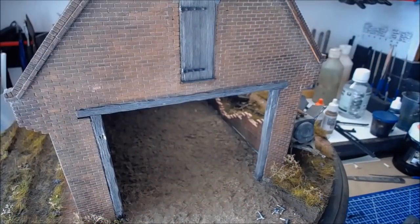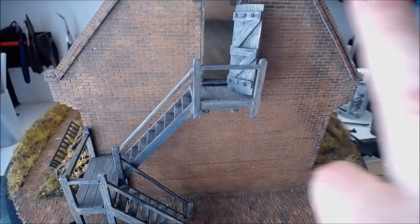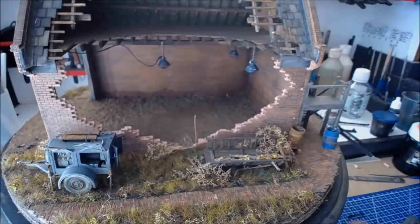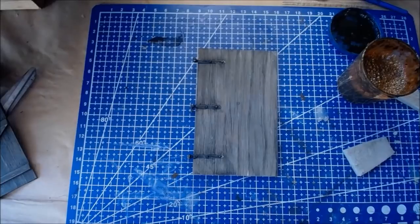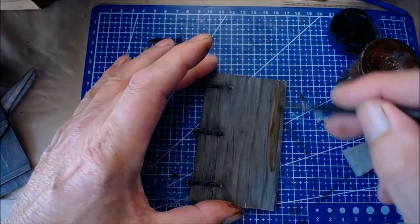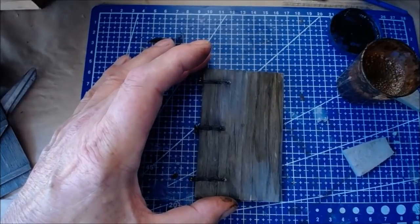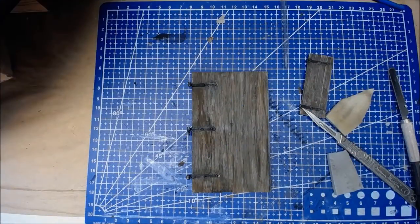I've lightly sanded all the woodwork. I've also done the fascia board on the side and the bits around the back — all just rubbed over so it allows the grey to come back through. Now my next wash is going to give it a little bit of warmth: a mixture of 25% brown wash with 75% thinners, so it's a really thin wash. I'm going to give all the wood a once over with that.